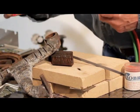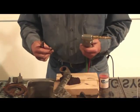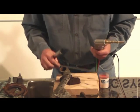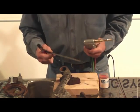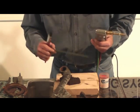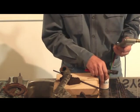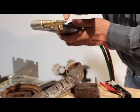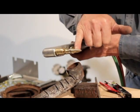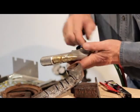Remember you can go from very thin all the way up to one-inch plate. Now we're using a cast rod — you can also use a cast iron piston ring if you have access to them. If you run out, a lot of places don't carry these rods, so your dealer should have a good supply. Remember, you're going to have to use a good high-heat flux — Cobra has an excellent one. Now we're using our number two tip. Remember, anything over an eighth of an inch, use that number two tip. If you're doing real thick stuff, we recommend our optional 2.5 tip.